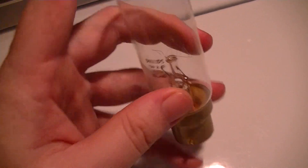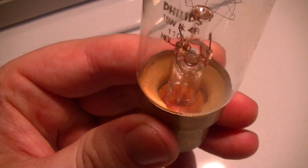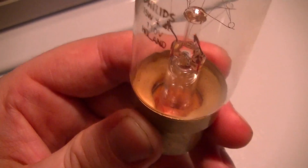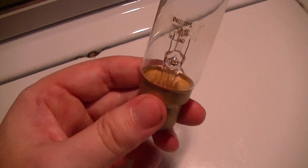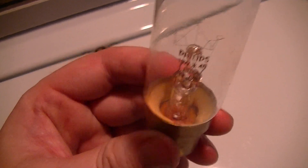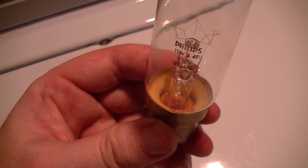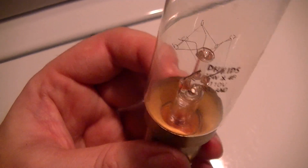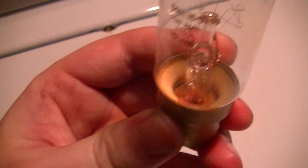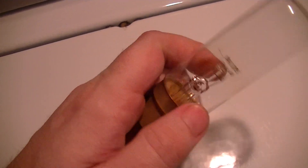Overall it's quite a decent quality lamp with a fairly interesting feature. You can see in the part of the envelope where the basing cement is, it has a pair of bits that stick in to help grip the basing cement. This is very good for preventing the envelope from separating from the base when the lamp is being inserted or removed, and also in the event of a lamp failure. You can also see there are two bits without ridges to provide torsional reinforcement, so the torsional shearing action of insertion or removal doesn't cause base failure.